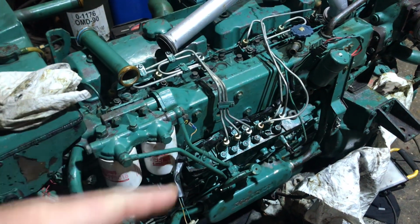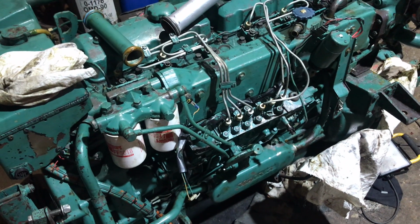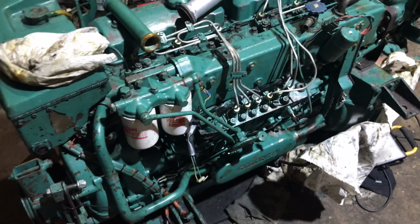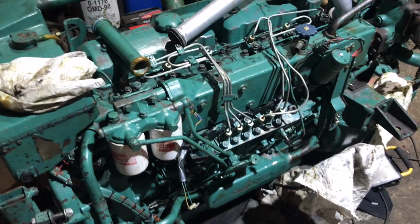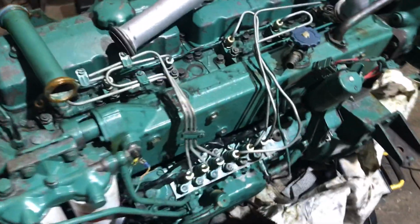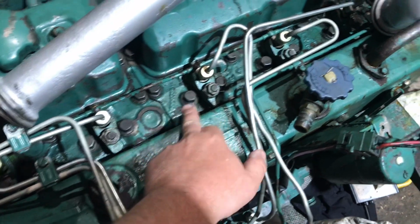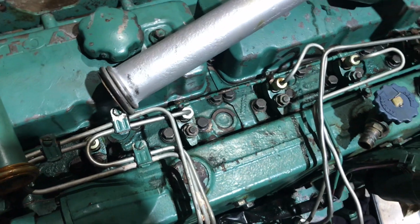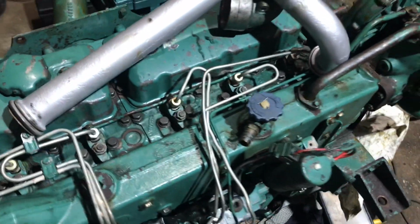But by this time, obviously, all the engine was back together. So then we looked at all the crank settings. They were all wrong too. Luckily, they were under. So some had to come back off, all stripped back out again, and redone to the correct torque setting. Because we overstretched all the bolts, head bolts, we had to buy all new head bolts as well. They weren't cheap, let me tell you that, and there aren't that many in the country, so we had to wait around for these. There's 40 head bolts in here.